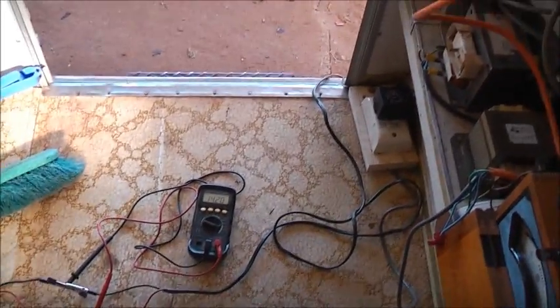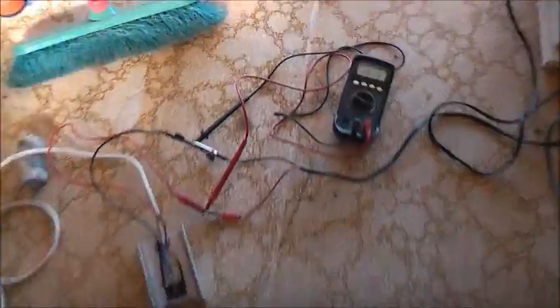Anyway, I'll go back to the ballast method. This seems to be dropping the voltage at the ballast — back to more of a transformer approach. It's going to take a lot longer to desulfate, but it's a battery charger nonetheless.